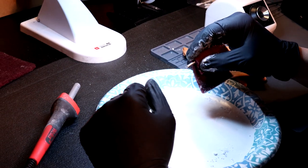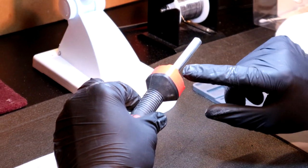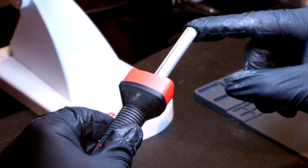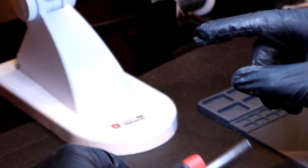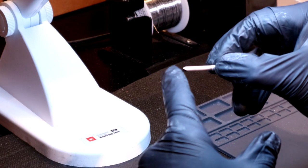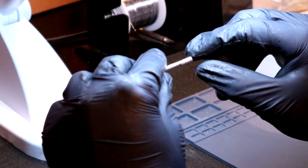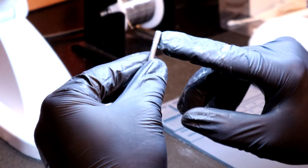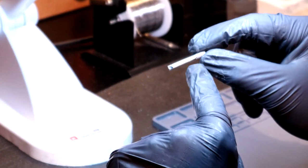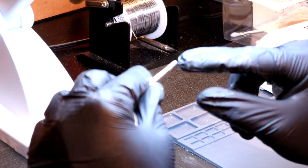In this part of the video I've already begun the polishing process — you can see this barrel is basically coming right back to life. I wanted to show part of it and then show you the before and after. This is being shot in 4K. You can see the tip — before, and now the after — that new finish is what most people are looking for. Over in the threads we actually have the copper exposed, and I highly recommend that because copper is a much better conductor than the plating they put over it.